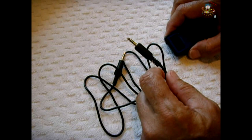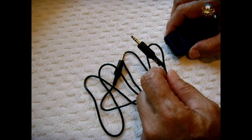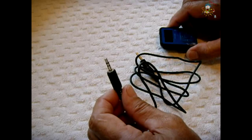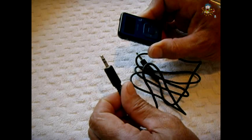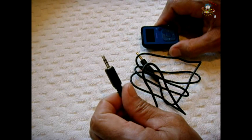On your recording device, if you do not have something that says Audio In, and you're using a microphone jack like on a laptop, you are definitely going to need this cable. What this cable does is take the audio output from your music player or any other device and reduce it to a safe level that you can apply to your microphone jack.